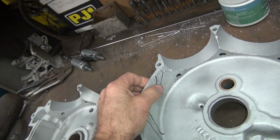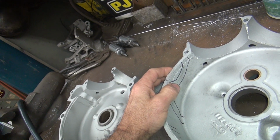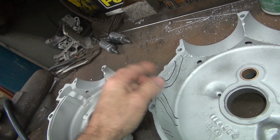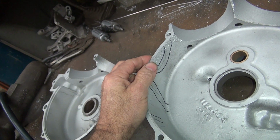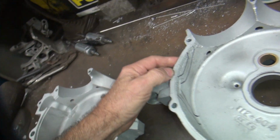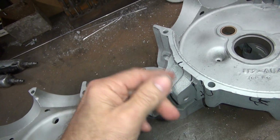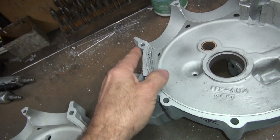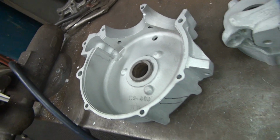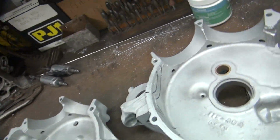The hard stuff is fairly good to me. It's a little bit hard to weld, I guess. I don't know, I'm used to it. And it's a lot stronger, but it has heat cracking problems when it gets over 150 degrees on billet materials. On the cast stuff, I don't think it matters. It works good. I've never had stuff crack after I weld it, and I've been welding it for years.